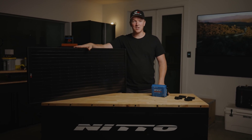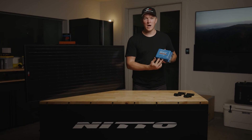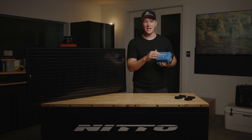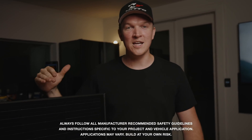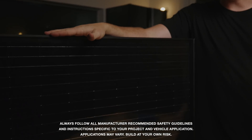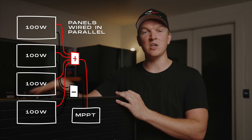You wire this up with pre-wired connections. You take your solar charge controller and it's literally four wires — two of them go to the panels, two of them go to your fuse block. That's it. We just wanted a bulletproof DIY solar setup, so we went with these 100-watt panels. These are extremely inexpensive, under $100 each. You can run them in series or in parallel, but for our system we want to maintain a 12-volt rate and increase the amperage, so we're going to run this system in parallel.